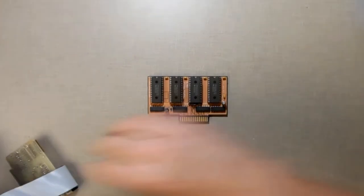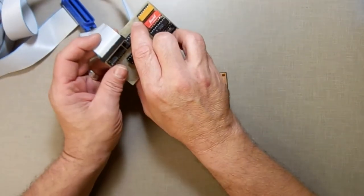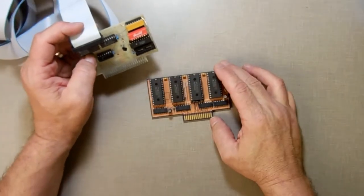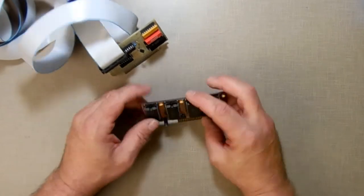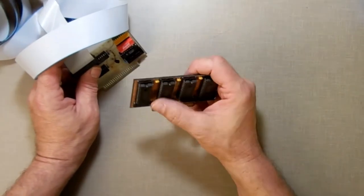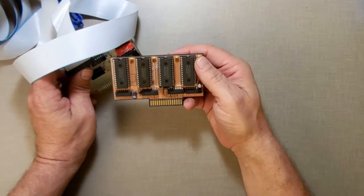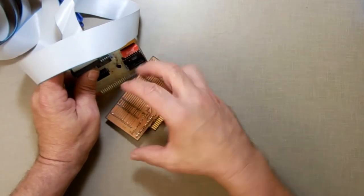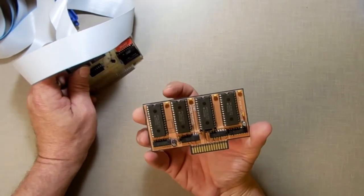This is a parallel card that you connect to a parallel printer, but there's a little solder position right there — that's the memory addresser. You wire that over with a single wire to your expanded RAM, and now instead of only having 64K expansion, it can access all the way up to whatever you have. It sends a signal over to page-flip between them. So I've got to figure out where that wire connects over here.